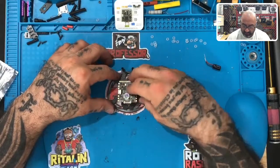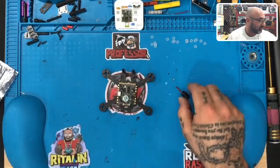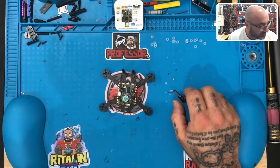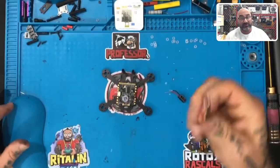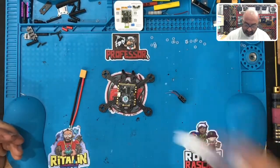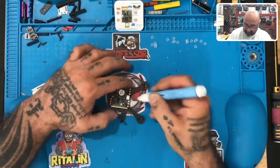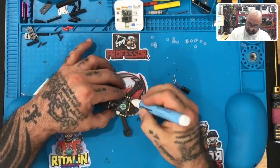On the flight controller, first we have our capacitor. I'm looking for my XT30 cable — here it is. This XT30 will be in your kit as well, sorry I didn't mention that earlier. To prep the board, I'm going to use my flux pen. Please make sure you use flux — if you don't have a pen, use any kind of flux — and go over all the pads so that when we pre-tin this board we're set.